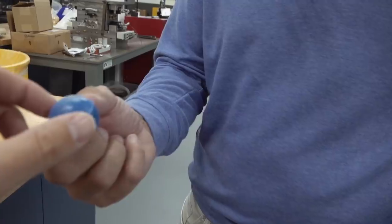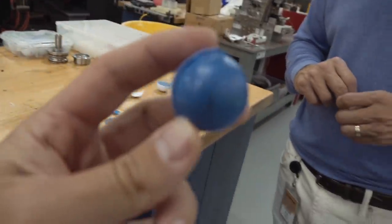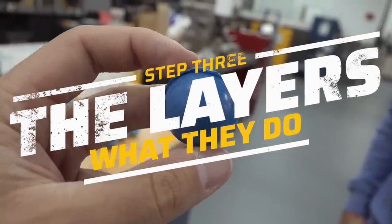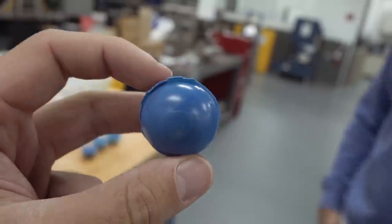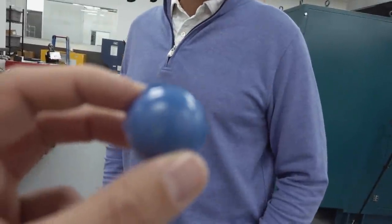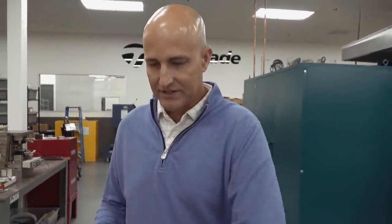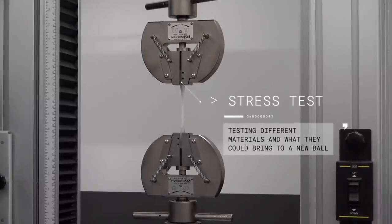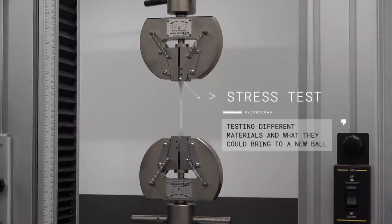This is what the core looks like as it comes out of the press. It takes a little bit of time to make it into this harder material. The cured core is resilient — if you were to drop that polybutadiene rubber uncured, it would just hit the ground and stop. We added materials to enhance it. We have a material that is quite flexible but very resilient, with a specific modulus we use to increase the speed of that core.